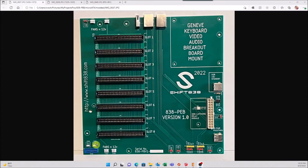What this allows you to do is, the micro GoTeks are so much smaller, and you can pretty much place them anywhere. They don't actually go into a drive bay. They're way too small. They're only a few inches long, maybe an inch and a half, inch and a quarter wide. And this allows you to hook up the data plus, data minus directly to the micro GoTeks. And this will allow you to use the front USB ports for your USB drive for the GoTek.